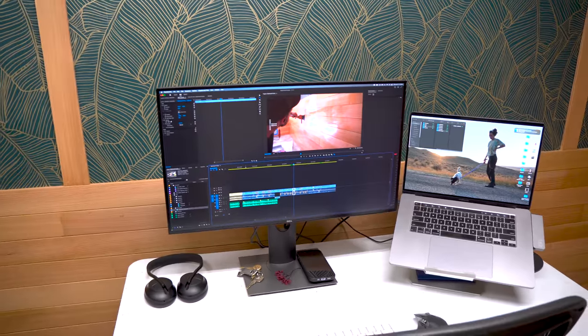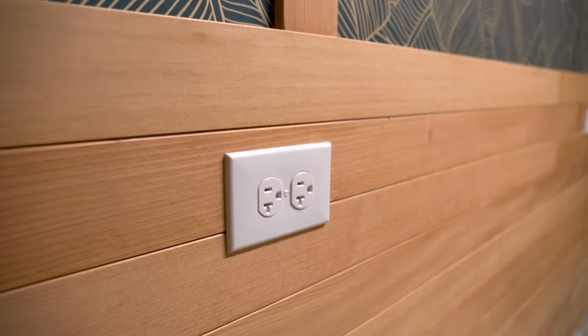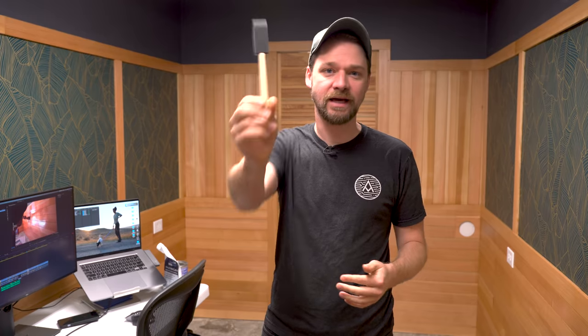There are five coats on the walls now and I've moved in — I need an office space, so I've been editing this video here. I've got the outlets installed and it's looking great. For smaller projects, I like to use foam brushes, especially for getting inside a drawer box. I've used water-based finish on drawer boxes a lot and a foam brush is your friend for that interior. I have tried wiping on the finish but had mixed results — it kind of messes with the sheen, similar to overworking the finish.